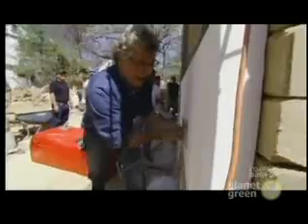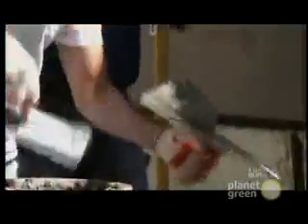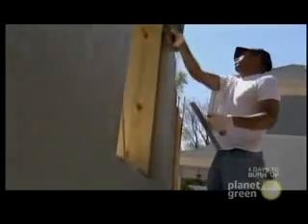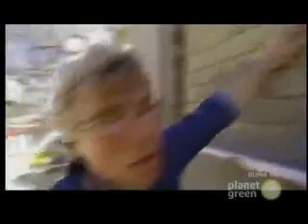An aggressive rasp with teeth evens out the foam surface. Then another base coat is applied, and on the outside of that, to keep it waterproof, a coating of synthetic stucco. It lasts a long time, doesn't need to be painted, looks great — and best of all, you can heat and cool this building passively. Very cool design.